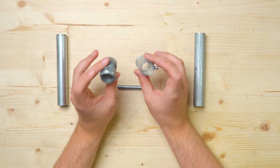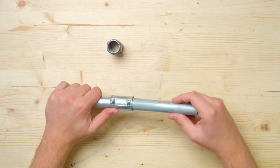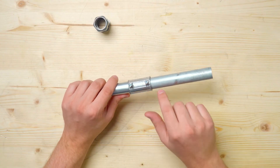On their own, these two couplings will offer pretty decent pull-out strength, but if we combine them with a method from earlier, we can make an even stronger connection. You'll notice that the two couplings are hollow all the way through, which means if we add a threaded rod through them, it's not going to hit anything or cause any issues. So I've got two no-lip inserts, one in each piece of conduit that I'm connecting. I'm going to add a threaded rod to one side, slide the coupling over top, and then thread on my other piece of conduit. You'll thread them all the way until it's super tight, do a pull-out test, and then screw down your set screws or add your self-tapping screw — and this is going to offer a really strong end-to-end connection. You can also do it with the compression fitting since it's hollow as well, but I think this method will be stronger because you're going to have those set screws or self-tapping screws that bite down into the conduit.